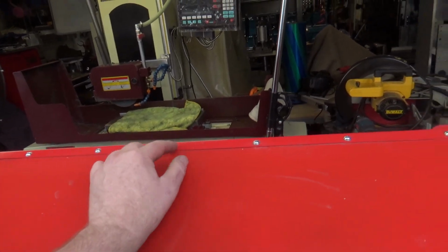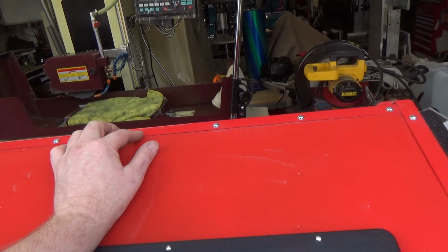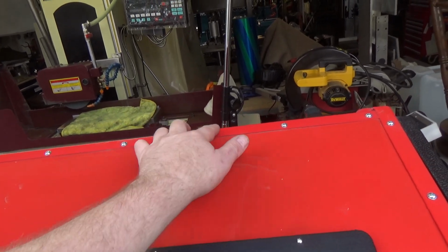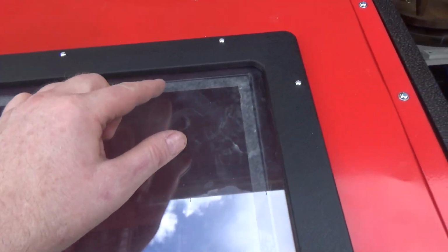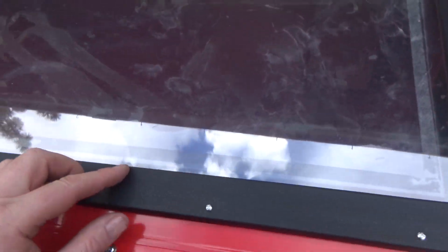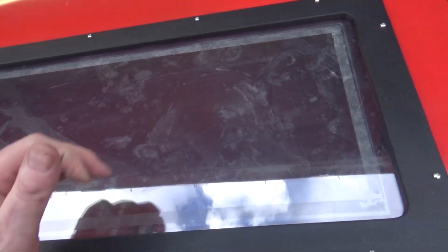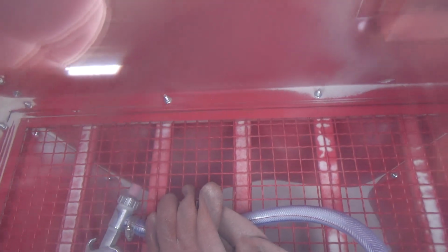Maybe if I put the washers on this side, which they showed to put them all on the other side, then it would have prevented the puckering a little bit. You never know. I think the nut twisting on this really thin material is not great. A little bit of media leaked out around the gasket on the top of this guy, and that's not great because, as I just touched it lightly, it scratched it. Also, the plastic on the inside is statically attracted, so it's sticking on the inside of it in a film.